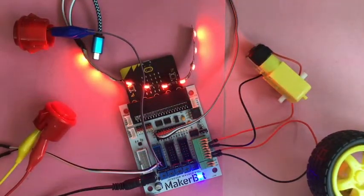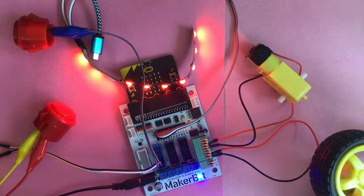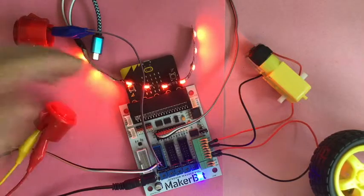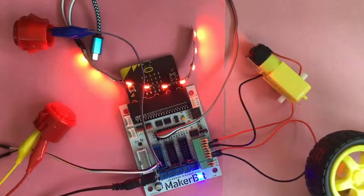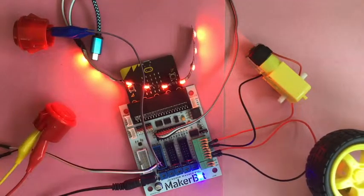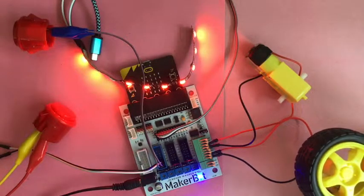You can see there's a lot plugged in here — you need an expansion board because you couldn't plug all this straight into the micro:bit, especially because motors need some kind of motor controller. I added two switches and some lights. Really, if I had two motors running, I'd want four buttons and two sets of indicator lights — an on/off for both motors and indicator lights for both.